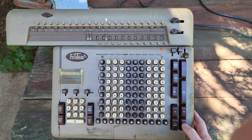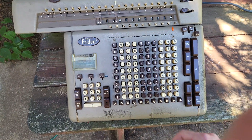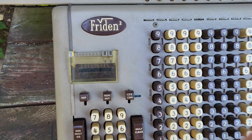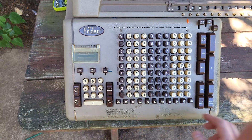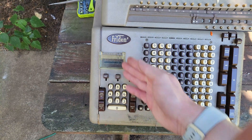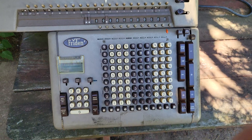Despite the fact that this machine has been completely gone through, cleaned, oiled, everything — there is nothing that's stuck or anything. I think it's just some wear, especially in the multiplier unit. You can watch how it sets the numbers in there — it does one digit at a time. There's a big arm that comes down and stops the multiplication riser at the appropriate time. I think that arm always coming out and hitting that has caused some wear, but as you can see it does work properly at least some of the time.